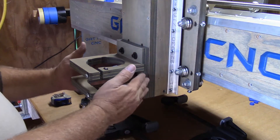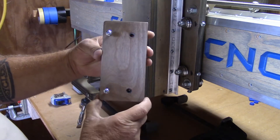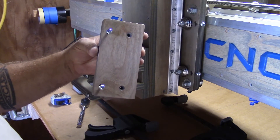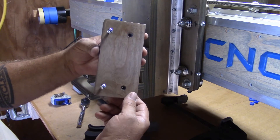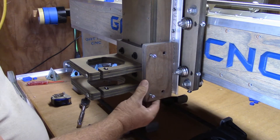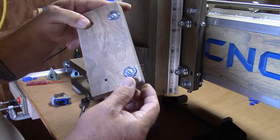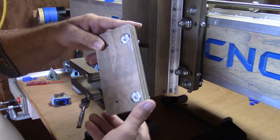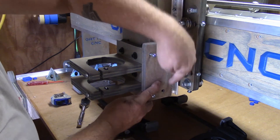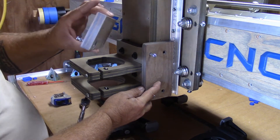Speaking of the modification I'm making, here it is — some plates that I made up. They're very simple, and I'll put a link in the description to a measured drawing over on my website. It's a very simple block that mounts on the side of the Z-box. These two screws here are 10-24 by inch-and-a-quarter long, and I've recessed a couple of T-nuts in the back. I'm going to clamp these up — they sit flush with the bottom of the Z-box — drill some pilot holes, and mount them to the side of the Z-box with a number-8 by inch-and-a-quarter long wood screw. I've got one for each side.